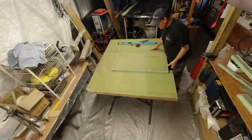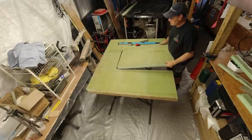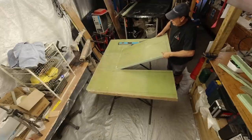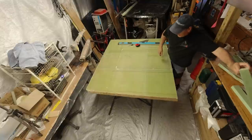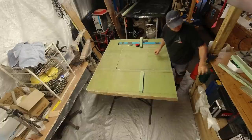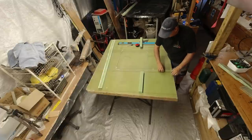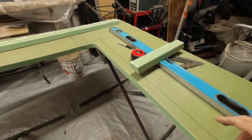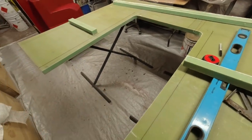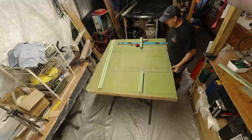I've got the hatch cut out and now I've got to work out how to brace this thing — it's going to need a couple of ribs and certainly a rebate to hold the hatch lid. This is actually upside down, so the hatch will go the other way. I need to brace it from underneath with a series of 30 millimeter battens here, here, and then a longer one across the back. I'll put an insert rib all the way around the bottom of it to hold it in place. There'll be some gas struts to assist in the lifting because it's not going to be light, but I need the rigidity in the piece to hold a bed and for dampening noise and heat coming through the floor.